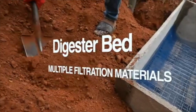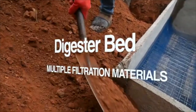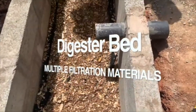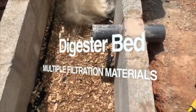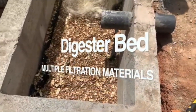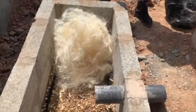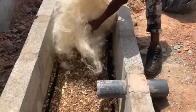You can still use wire mesh, keeping in mind that a biodigester, when done, will typically last 3 to 5 years before maintenance work needs to be done and all materials inside the digester bed replaced — so wire mesh will work fine in any situation. The next step is to line the digester bed with two layers of fiber net or mosquito net, placed directly on top of the wire mesh or porous layer.